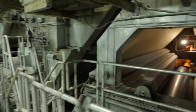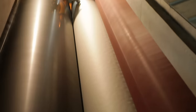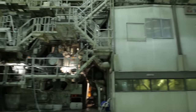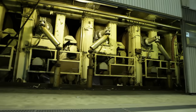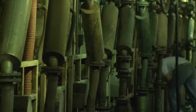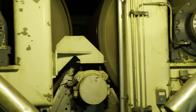The second station in the huge machine is the presses. Rollers press the wet fiber layer onto a special covering called press felt, which presses the remaining water out of the fibers. But even now there's still too much moisture in the paper. That's why it has to go into the 65-meter long heater, a roller mill. The roller's temperature is 110 degrees. This treatment has an obvious effect — the thin layers of fibers on the wire become bone dry, and only now do we finally have white paper.